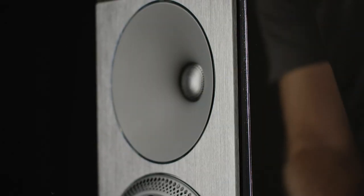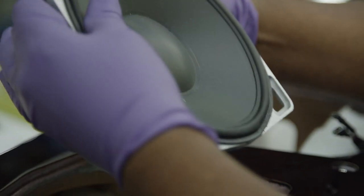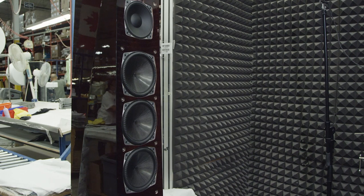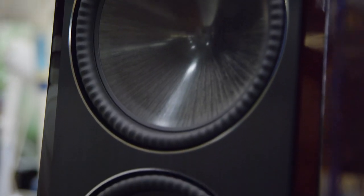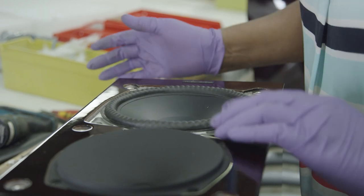All models in the Founder Series use the same tweeter — it's a one-inch aluminum magnesium ceramic-coated tweeter with an oblate spheroid waveguide. Both the 120H and the 100F use a six-inch aluminum magnesium mid-range with a two-inch high-temperature voice coil. The 120H and 100F also share similar bass drivers — they are Carbon X — while the 120H uses eight-inch and the 100F uses seven-inch. The 80F, being a two-and-a-half-way, uses a six-inch mid-bass made out of aluminum magnesium with two Carbon X six-inch woofers.